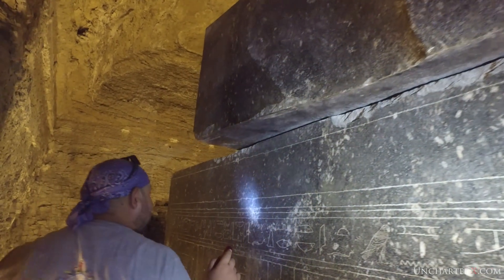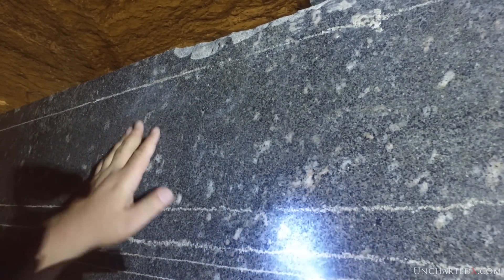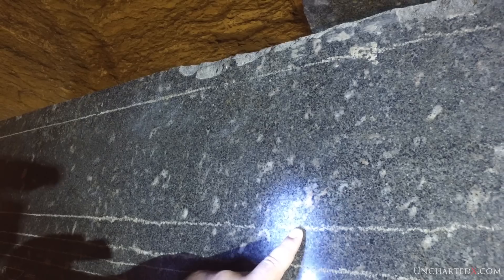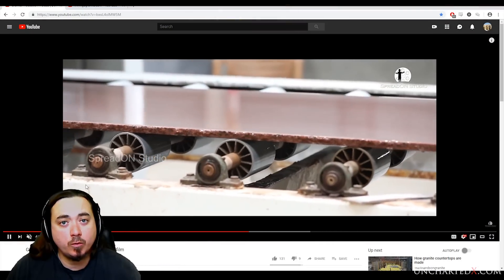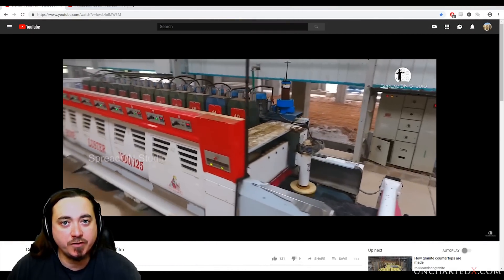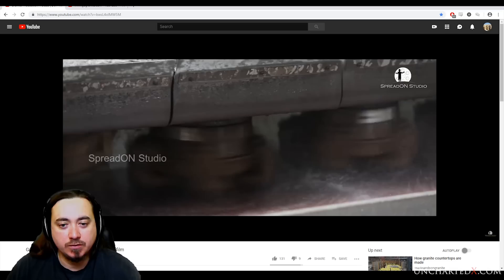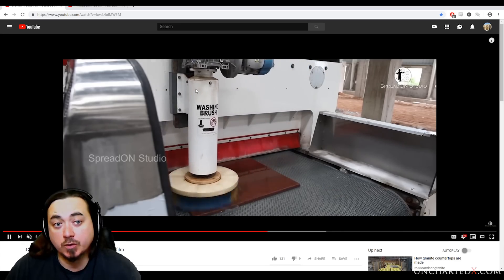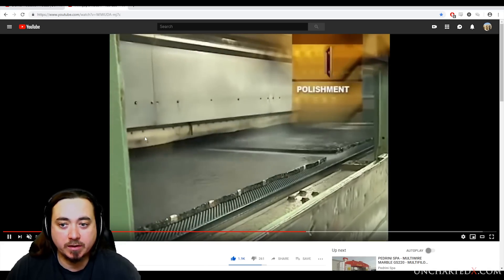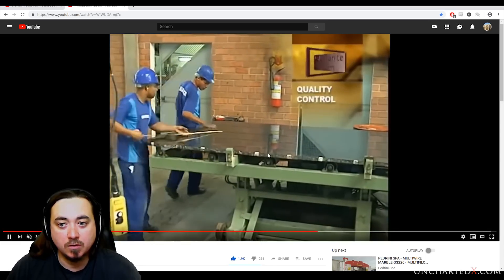Suggesting that this was done in antiquity by hand, just using rocks and sand and water and rubbing for long enough, is frankly inconceivable. Polishing the indentations is an extremely difficult ask — we don't polish indentations like this; we tend to make flat surfaces of granite and polish those, and that's how our machinery is set up to work. We use giant polishing machines with abrasive pads and abrasive materials to polish and finish granite to this point, and it's always done on a flat surface. We're not really set up to polish divots or to do anything like that.